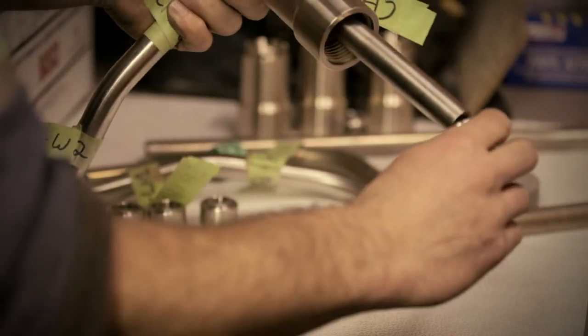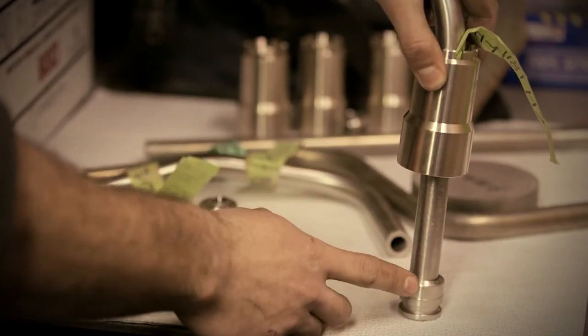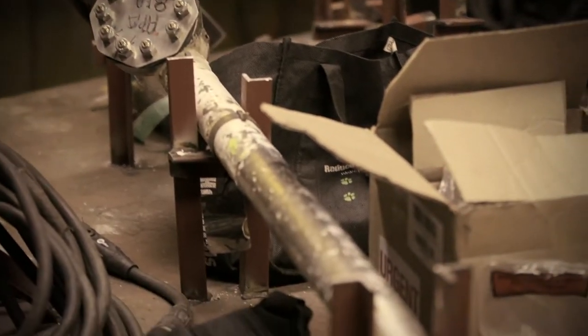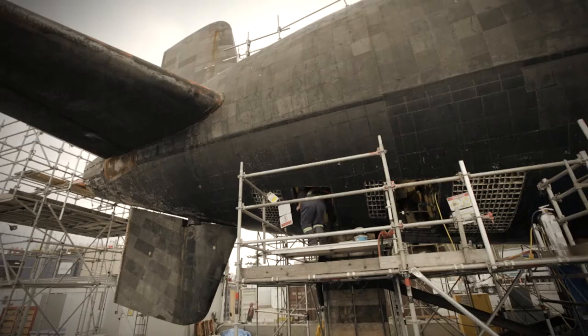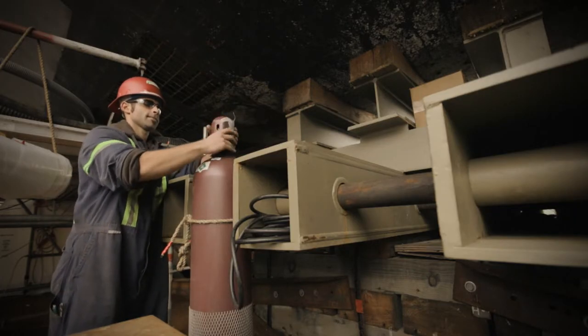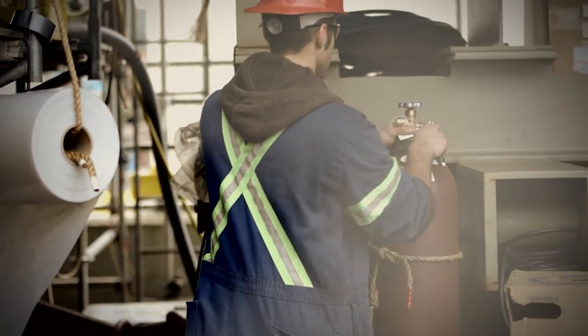I fabricate different styles of pipe, flush the pipes, take the paint off them, get the flanges prepared, and do bolt up. Marine fitting is a lot different than industrial fitting — industrial fitting is more of running the pipe straight through the oil fields. We have to really go around a lot of objects, especially on a submarine being a stealth boat, and make sure that everything has a certain gap in between. The first thing I do is make sure everything is on and ready to go — all the bottles are tested. Bottles would be anything from oxygen to acetylene for cutting or heat treating. Then we fire up the bottles and start our day, whether it be bending, fabricating new pipe, or heat treating to release stress. Then we get on the boat and start measuring up.